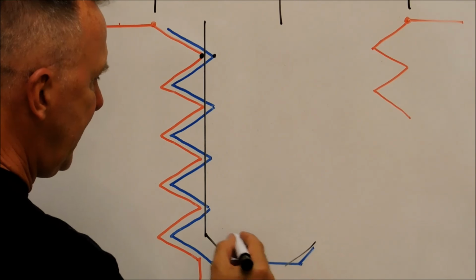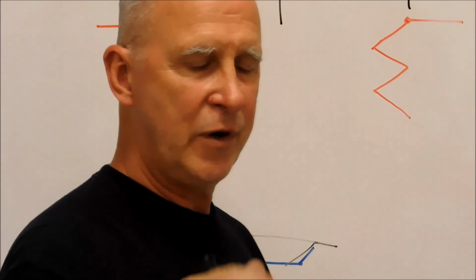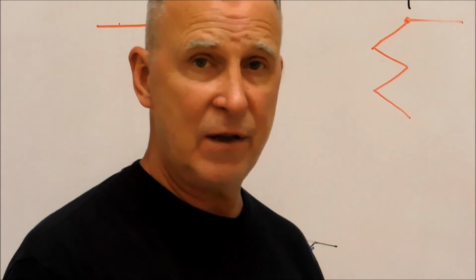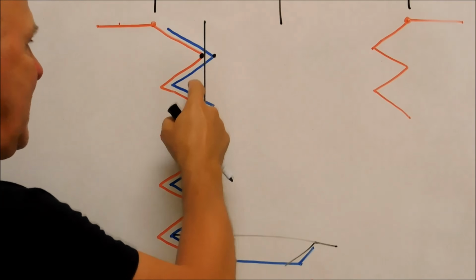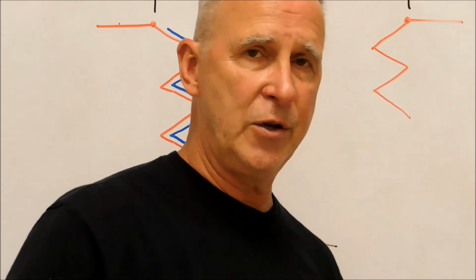As you're drilling through this, there's a little chunk at the bottom, and you'll feel it. The pressure will increase because it has stuck to the front of your drill and it's acting like a little hat on the front of the drill and it's just not going to cut anymore. Pull it out, see if it's stuck to the face of the drill, blow it out, whatever. Then go back and pick the helix out in a counterclockwise spin with a pair of needle nose pliers. I will do that for you. Let's take a look at the tools.